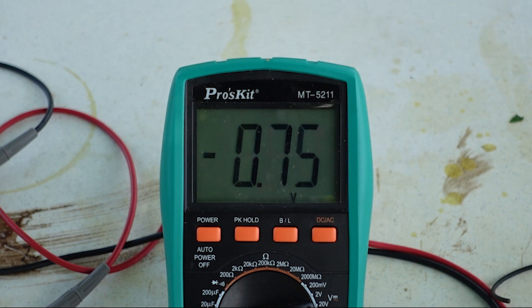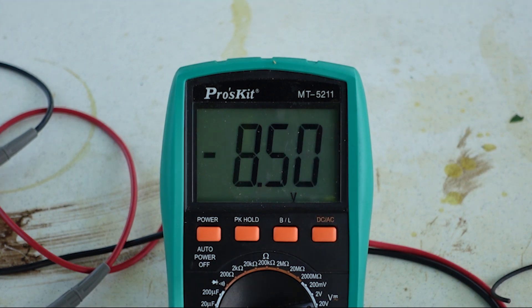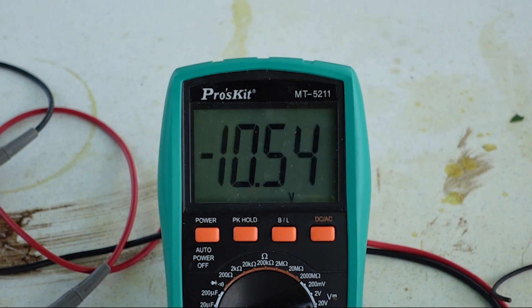Let's get rid of the add-on wire. It seems to be incredibly positional. I'm moving it around — I've got it spread out. Essentially, we've created a dipole at this point. Let me try putting it on the back side of the radio — it was hanging off the front. KN4YCD test, one two three four. So that's pretty terrible. That is a 19.5-inch wire. Let me knock off about three inches — that's better just getting rid of three inches. Knocking it down two or three inches every time — we're almost back up to without the tiger tail, and there's not much wire left, about 10 or 12 inches.